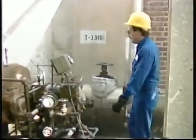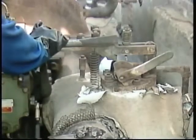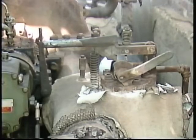What we're going to concentrate on in this part of the program, however, are those preparations that are common for most single-stage steam turbines. Getting a turbine prepared for startup generally begins with an external check of the turbine itself. Look it over for any signs of damage. Make sure that the overspeed trip mechanism has been reset and is in good condition.